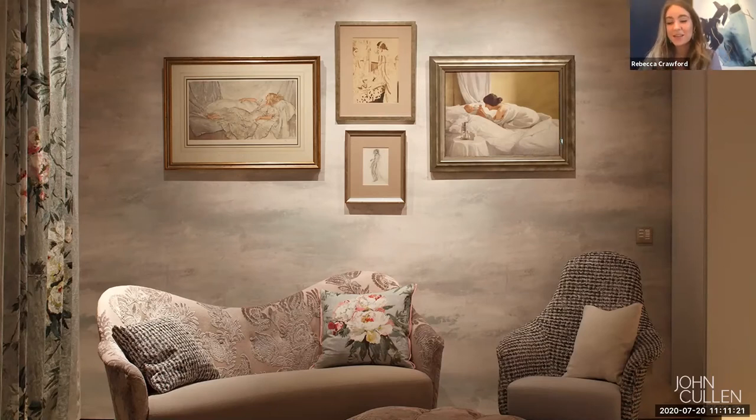The use of lenses is an incredibly important tool. I'm talking about adding a sandblasted glass lens in front of the beam of light so that you get beautifully soft light onto the wall. It's also important to consider, as we start with downlights, you cannot just position them anywhere you want. If you've got a wall where you know you're putting artwork, you have to consider the exact positioning of the downlights based on the height of the wall and the amount of art being positioned in the space.